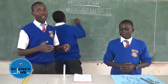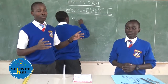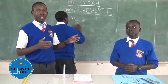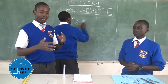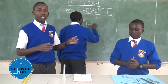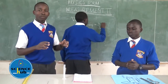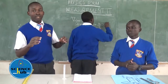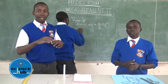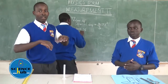So on that, my colleague has mentioned something to do with the lycopodium powder. So you might be wondering, what is this lycopodium powder? A lycopodium powder is a powder which, when you are determining the measurement of the oil drop, you spread on the surface of the water. And the use of the lycopodium powder is that it reduces the surface tension of the water, thereby making the oil drop spread to its maximum